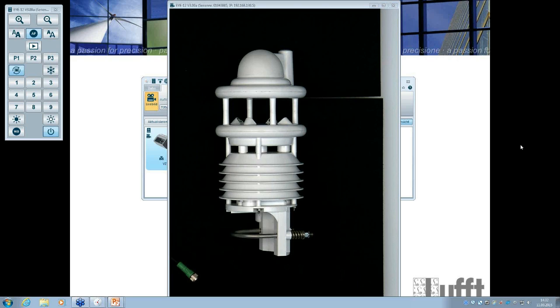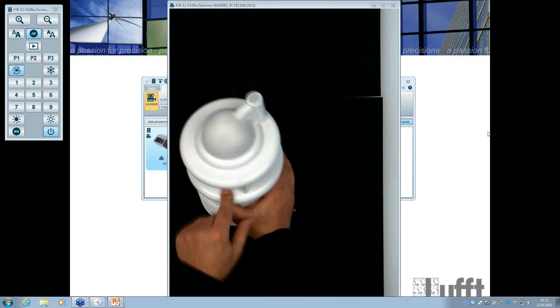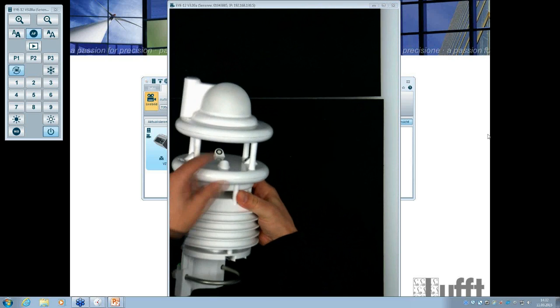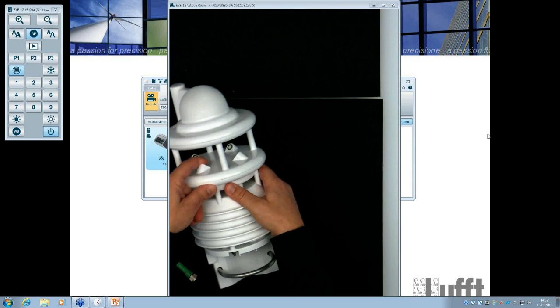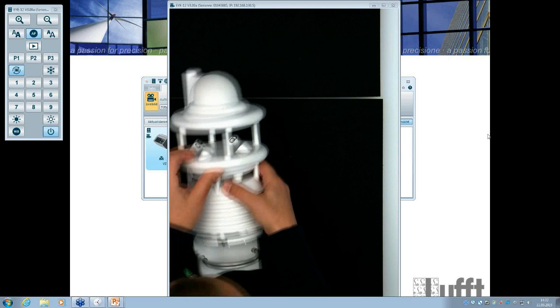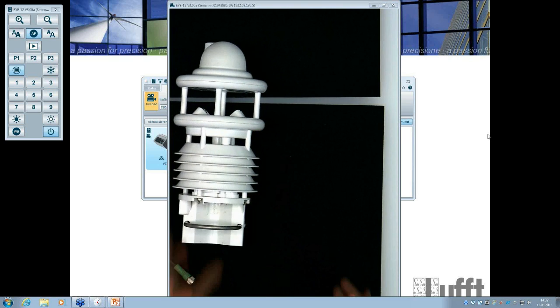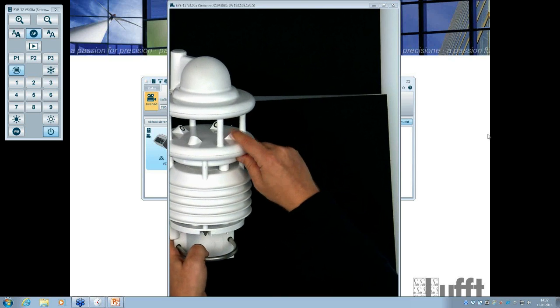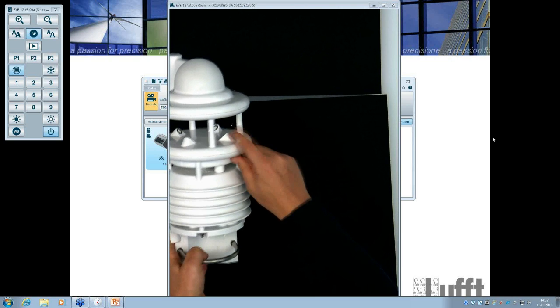And if we have some dirty spray or paint on the ultrasonic sensors, of course, if the ultrasonic sensor is covered, that's very bad. That's also the reason why it's heated during wintertime, because if there is an ice layer over one of the measurement elements, covering it, you will get no values anymore. So these ultrasonic elements always have to be free, okay? No paint, no cover, nothing. They have to be free.